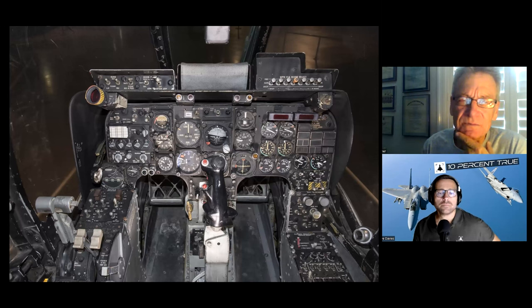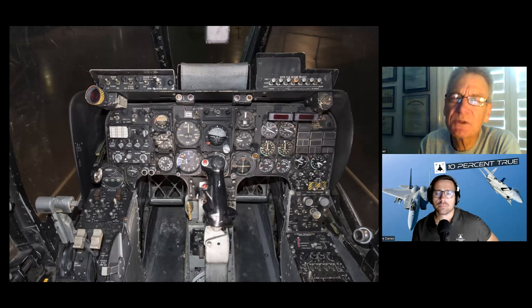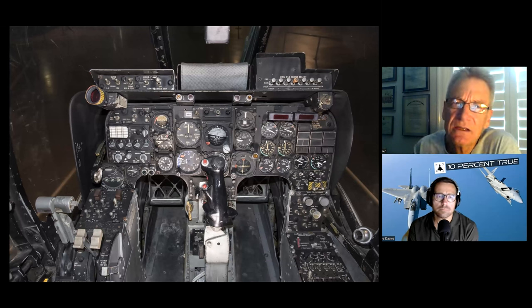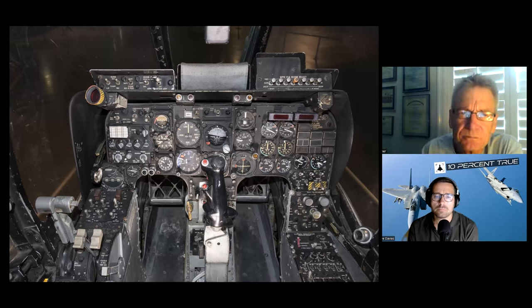If you were carrying actual bombs like Mark 82s, here's nose-tail fusing select and here's master arm. This is a map container — it might contain your FAC maps, but it usually contained instrument-type stuff. These are the weapon station select switches: the center is where the fuel tank was, the adjacent ones are the sponson stations, and if the airplane was modified to carry weapons under the wing, that's what these would be. This is an over-torque light — if you were asking for more power than the engine was rated at, the orange light would come on. If there was an overheat inside the nacelle, there's an overheat light. There are also fire pull handles to go with that.